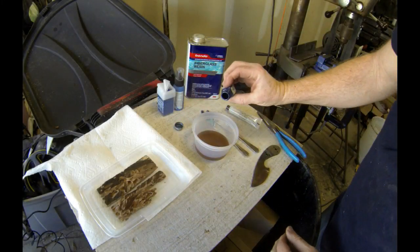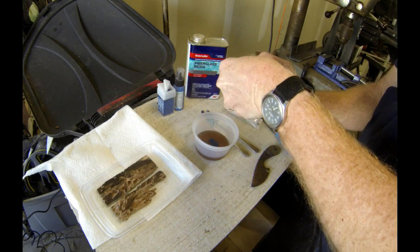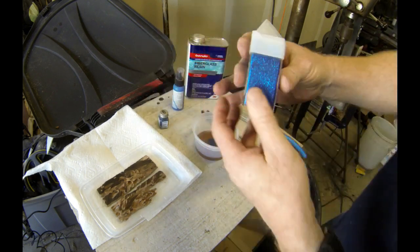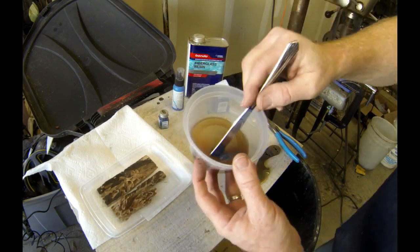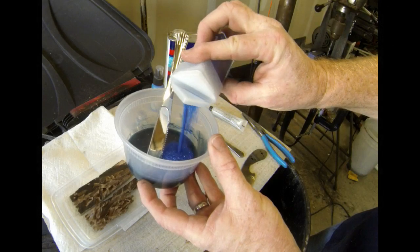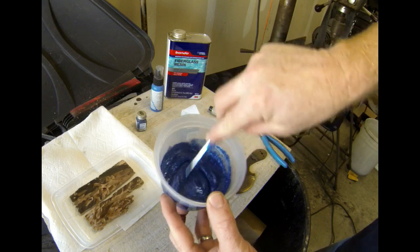What I was really looking for were the worm-eaten sections in the middle of that maple. I cut a couple small slivers of that, put them in a small Tupperware container, and then mixed some fiberglass resin. I added a few drops of blue paint and mixed that very well into the resin — I had not added the hardener yet. The concept is to pour this into all of those wormholes. This hybrid handle is meant to be an equivalent to hybrids made out of alumalite that require a vacuum chamber — but this is a much simpler process.